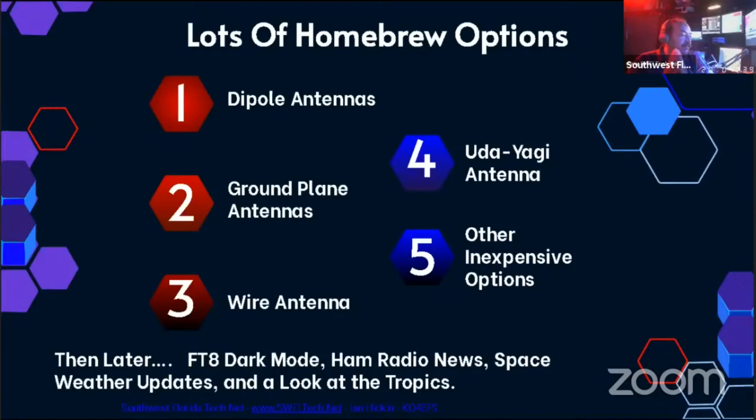But I want you guys to understand what brought this about this week. I always like to tell you guys what made me choose this topic this week. I spoke to 3 different people this week that told me that they have bought a 220 radio and they're having a hard time getting into the 220 repeater. And I want to start by saying they're outside the 10-mile radius. So it's not that there's anything wrong with the 220. The 220 is a strong machine, great antenna, good location. The problem is just we got people out in Buckingham and people out in Estero and people up in Charlotte County that aren't able to get it.